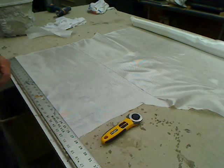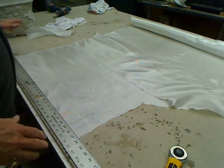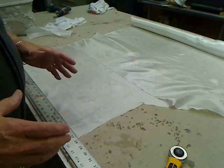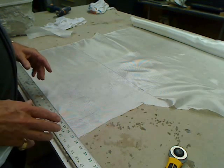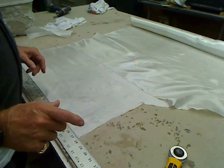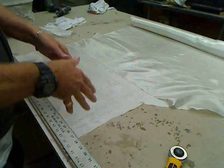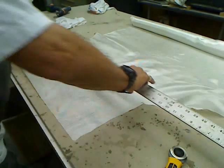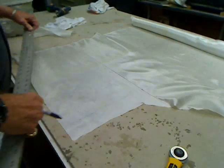This part is going to talk a little bit about cutting your fiberglass. This is a tapered cowl, so I've determined I'm going to use strips — about 14-inch long strips to fiberglass this cowl. They're going to be three inches on one end and five inches on the other, so I don't have a lot of bunching up of material in the bottom of the cowl. What we'll do first is mark off with a magic marker — that's 14 inches there.